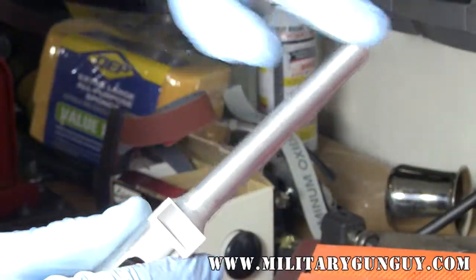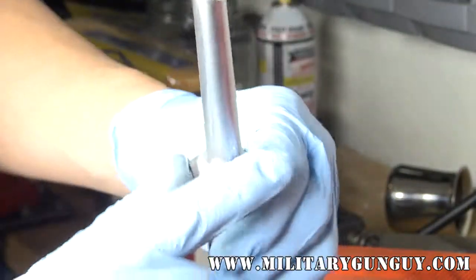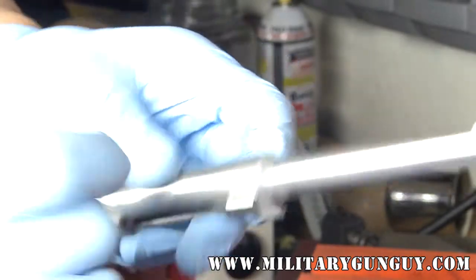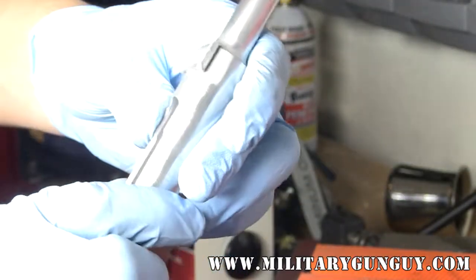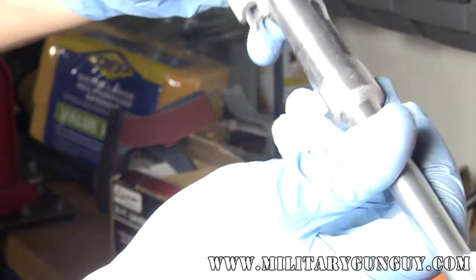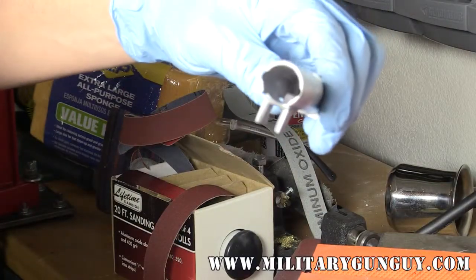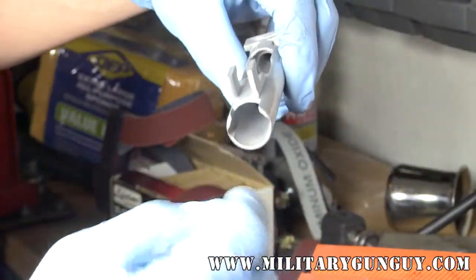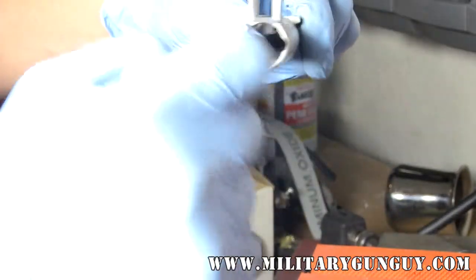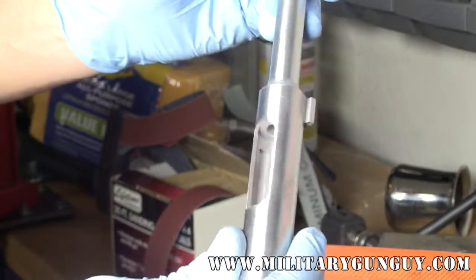You can see this was pretty heavily pitted — the pits are about 95% gone now. I'll have to get up in here by hand to clean this area up and blend it. There's still some pitting in there; it's going to be a little tricky because I don't want to ruin that barrel contour edge. I'll do this by hand and smooth these areas out. When it's done, I'll degrease it thoroughly. I'm going to leave the inside in the white — I may go in later and hit it with a stainless steel brush on the Dremel, since these are polished on the inside.